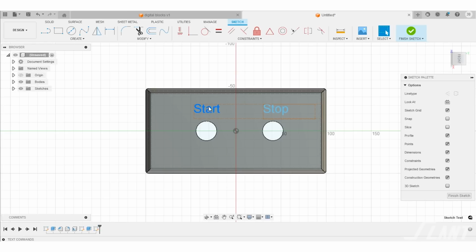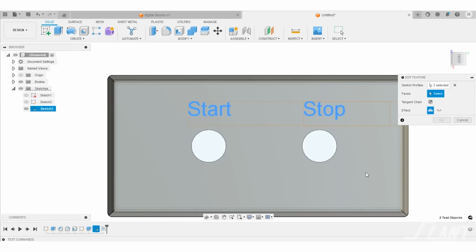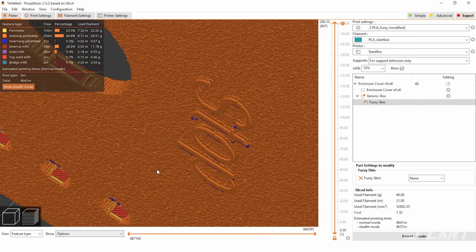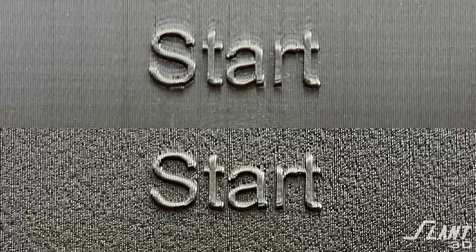Now, once that whole panel is done, you also have the text. The text itself you can separate from the rest of the panel. Very often when people 3D print them, they produce parts like this, where there's not very much contrast with the text. What we have done is apply a texture to this panel, which is applied digitally so that it is actually printed with this texture on it, which gives it a very nice pinned look that is not very common and is way better than the virgin 3D printed look for this kind of stuff. But while the main surface has that texture, the text itself is totally smooth, which gives it a nice bit of pop and contrast compared to the rest of the part.